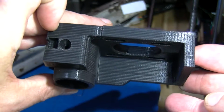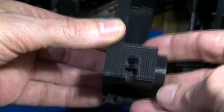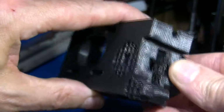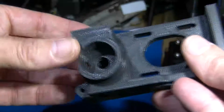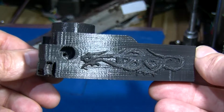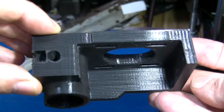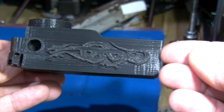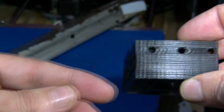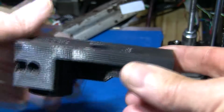Anyway, I'm going to now get these supports off, just some long nose pliers, clean up the holes a bit using a round file, possibly a drill bit, most likely a round file actually. They're quite good at doing things like that, and see how well it all fits together. That is a very, very good model. The only thing there is that edge here. Almost as if it shrunk here. But very flat, that edge, as I showed you.